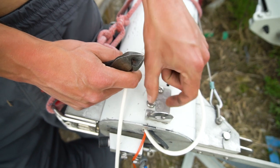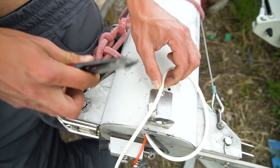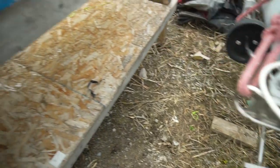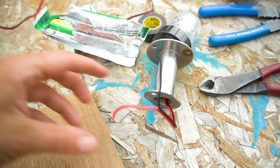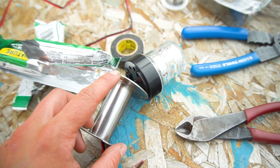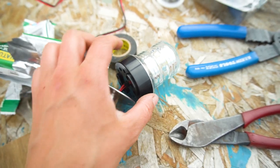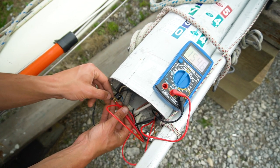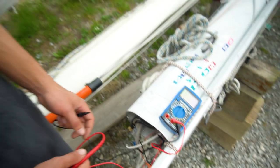We figure we need a little extra cable to get to the bottom of the VHF antenna, so we're leaving some slack — we might have a little excess but that's fine. We've got new wires with a new light, using the old mount since we've got to shove all the other wires back in there. Now we know which wires go to the top of the mast — the ones that beeped — so when I wire it up I'll know which ones are the spreader lights and which ones are the mast anchor lights.